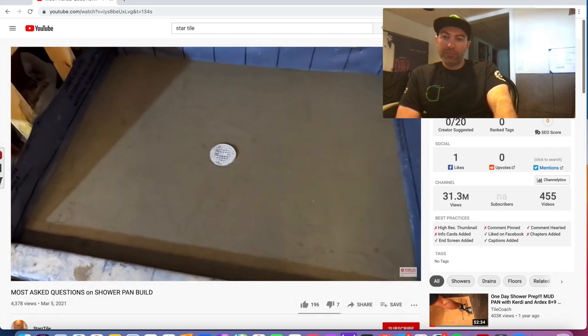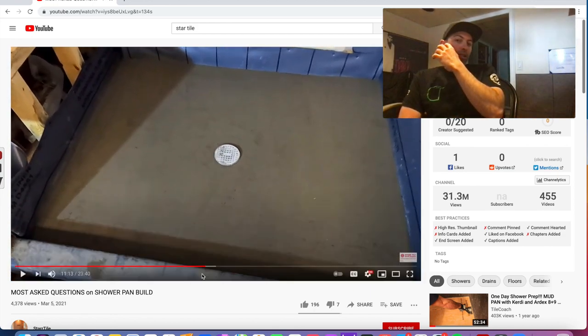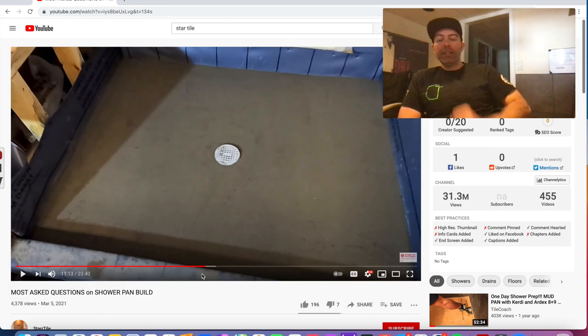Roughly about an hour. Sometimes if they're smaller. Okay. Time to pack your pan, okay? Pack your shower base, screed it, float it, whatever term you want to use, just don't use slop. That's going to vary, you know. Maybe the shower is on the third floor, you got to hold the mud up. There's a lot of variables, but as far as actually doing the work, once everything is mixed and you can start floating, you got everything prepped, ready to go, yeah, it's going to take a half hour, it can take an hour and a half.